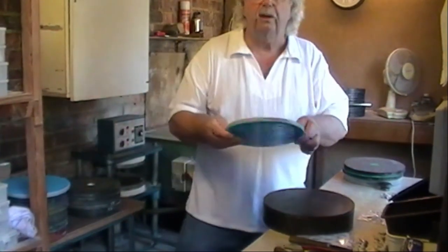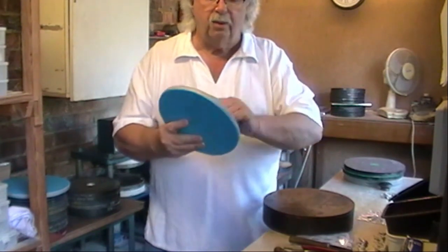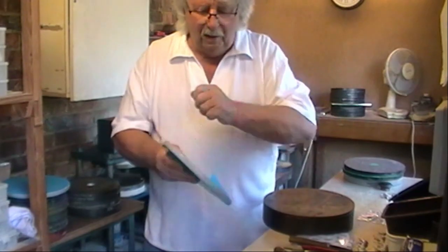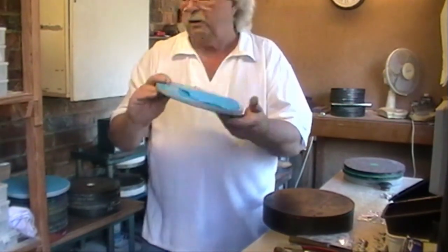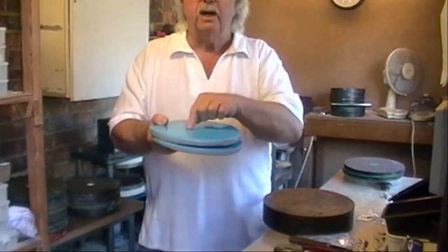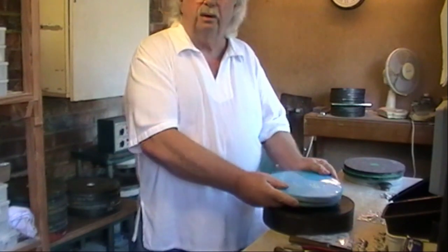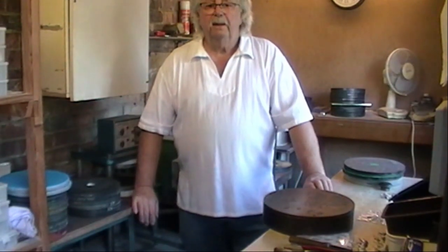The other reason I say this is because the other type of mould that we use is a grey silicone mould. It's the same principle. You have a plastic cover that you take off both sides, a top and a bottom, and you've got to cut a hole in the centre of one of them, so that when you put it in the platen, it's exactly the same as a black mould, except when you're using silicone, it's a bit of a lower temperature and it's less pressure. If you're making masters out of milliput, you can actually use plastic to make some masters, and the silicone mould is very, very good for doing that.